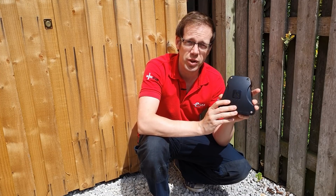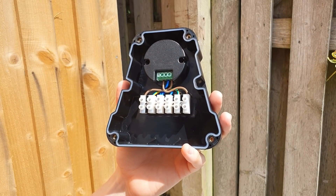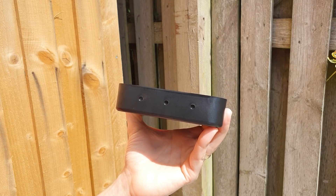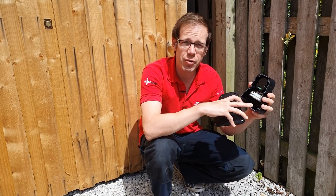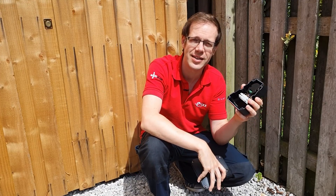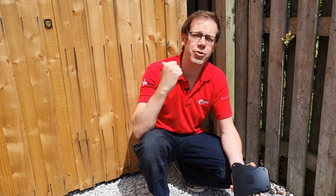There are a few things I really like about this product. It's not just a square box on the wall — it's got plenty of room to bring cables in, nice large terminals, recessed pips in the bottom to act as a drilling guide for the entry holes, and it's rated IP65. To sum up the front lighting: I'll bring a supply cable into the box and connect it to the permanent live side, then the outgoing cable to the lights goes into the switch terminal. I'll pick up a feed from the lighting circuit at the other end of the house to supply the PIR detector. These two devices plus the switch will then communicate wirelessly to control the spike lights.